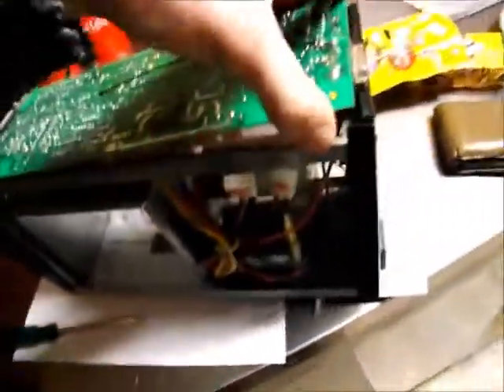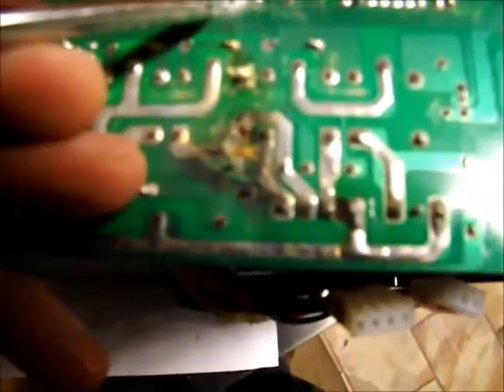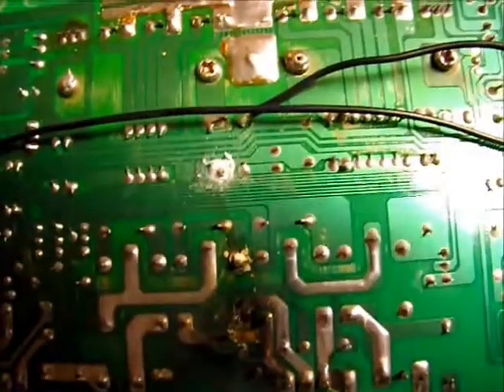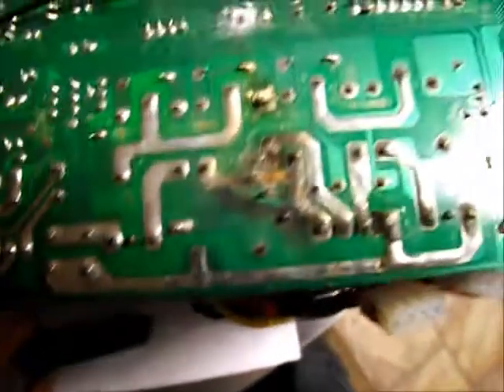What's happened — and this is the cool part — the damage to the board is basically limited to some corroded joints. Under that corrosion there may or may not be copper left; I haven't cleaned it off, this is just how I found it. It's obviously flashed that track off the board. You might be wondering why that track got flashed off. It was actually violent enough that if you look at the underside of the lid, it's got a deposit of copper on it. That's fairly unmistakable when you've seen it once or twice.